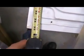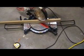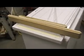I cut off all those pieces of plastic that were sticking up on the edge. It's not beautiful, but you can see how I put this on the very edge here — it clears it on the inside. I'll probably just put a bead of silicone caulk in there to clean it up a little bit. Next we're going to measure the length and width of the lid, set the miter saw to a 45-degree miter, and cut all four pieces for the collar. I got four pieces cut out now with 45-degree miters on them so they'll fit together nicely on the corners.